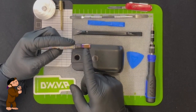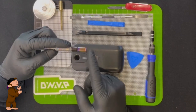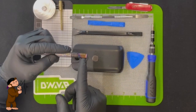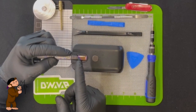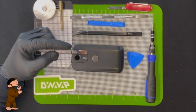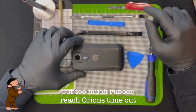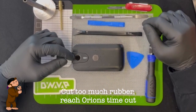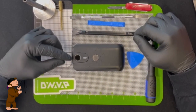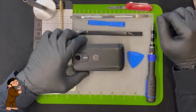Currently, the center of the induction field on the Orion is somewhere up in this range, which causes the click to come very quickly — so sometimes you're not getting really the performance you want. By cutting the rubber and dropping it down, you're going to end up with the center of the induction field lower, making it slower to click. But if you cut too much off the rubber, the click will be too slow and you'll reach the Orion's timeout, so we're going to go slow and cut a little bit of rubber off at a time.